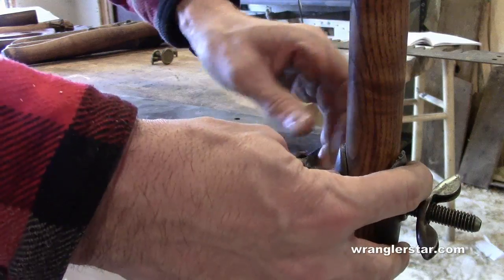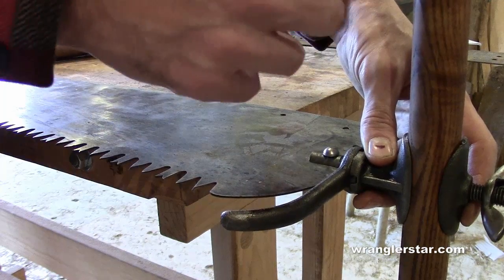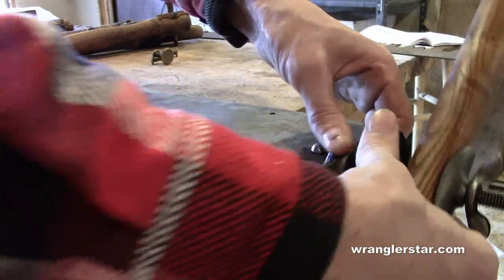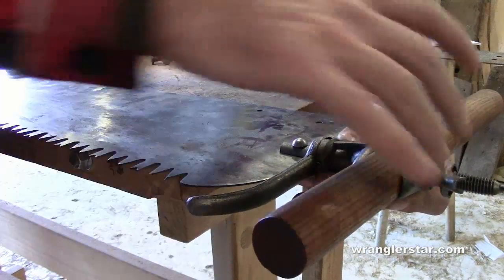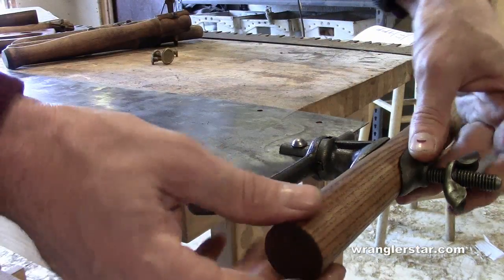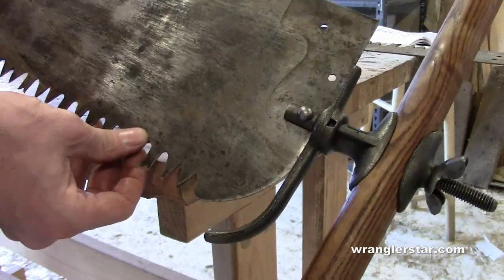So right here you can see the advantage of the Pacific Coast handle, because if you needed to use this to cut down or fell a tree, you could run your handle in a vertical position and cut back and forth this way. Or, if you're bucking, you can simply move this over and line up the teeth, and then you have its traditional shape right there. So it just gives you every option, and you can have the handle up, you can have the handle down. It's no question the way to go. So if I tighten that up there, you can see that that is going to be a great handle design